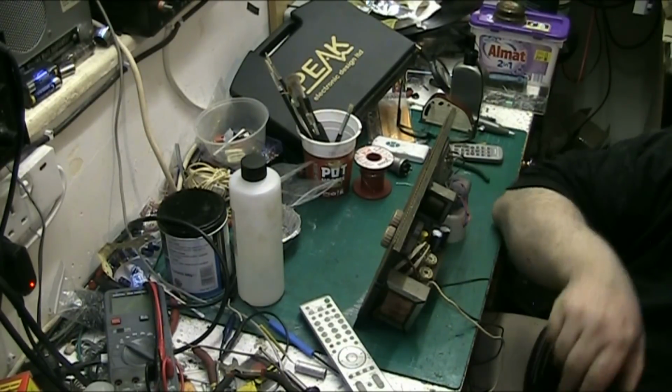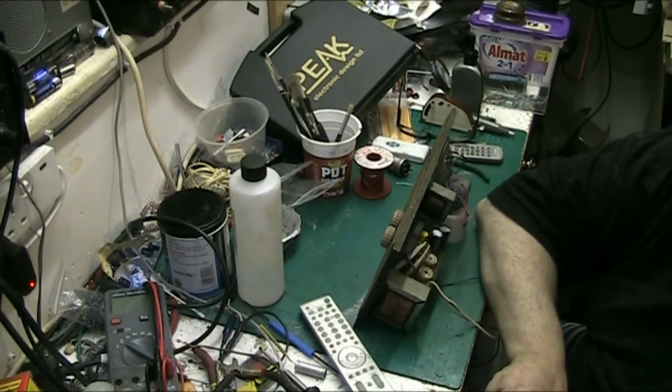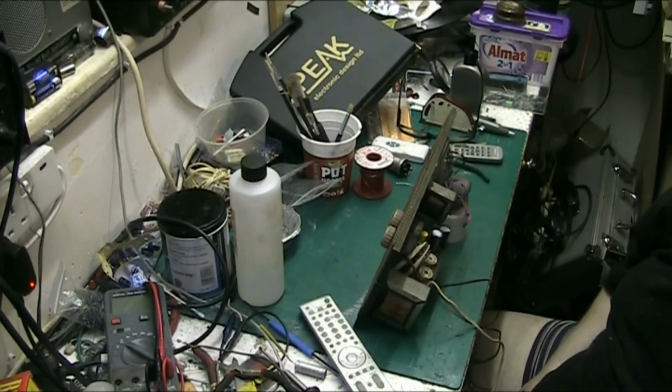because I think it's the safest way to do it in those particular units, because at least if the plug ever gets broken or comes off, everybody with common knowledge in the UK knows that brown goes to the fuse. It's brown to the right and blue to the left, looking at the open side of the plug with the plug open. So nobody in the UK should ever get that wrong. That's the way I like to do it. But if there's an isolation transformer, there's every likelihood that you're safe to earth it, as far as I'm aware. If there's any points where people think I'm wrong, then you're welcome to comment on them. That's fine. But I think I've covered everything extensively.